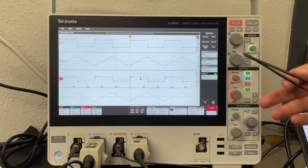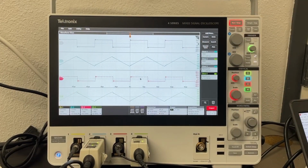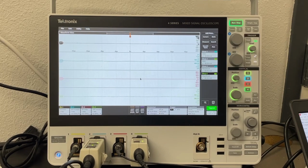Now we'll run the circuit with the same parameters and the same power and voltage conversion with the new modulation to see how we can reduce the RMS and maximum current and accordingly reduce the conduction and switching losses. And now we will check the same results for the new modulation method. I've uploaded the DSP code, and I will run the circuit for 100 volt to 50 volt to check the waveforms.